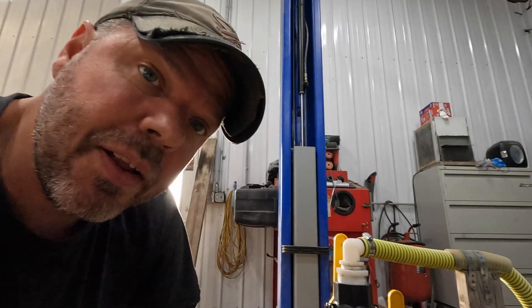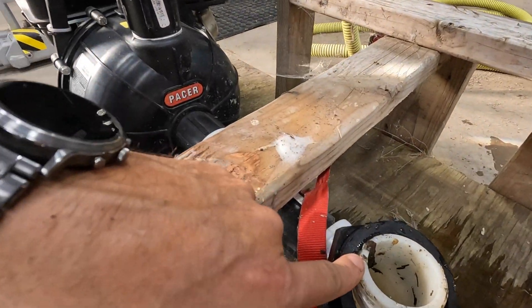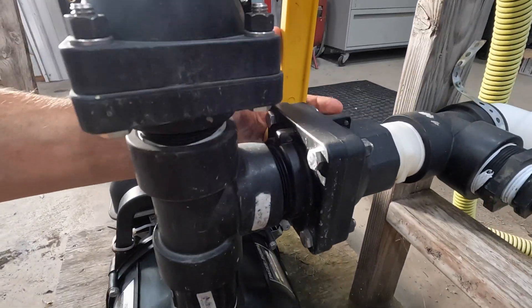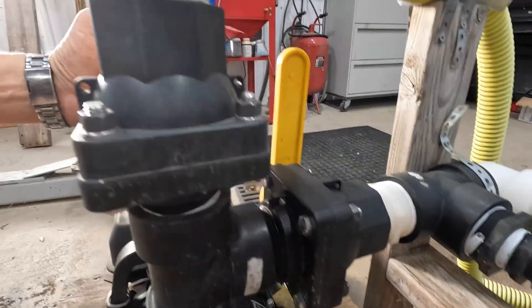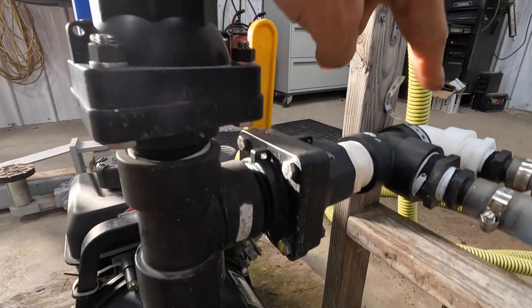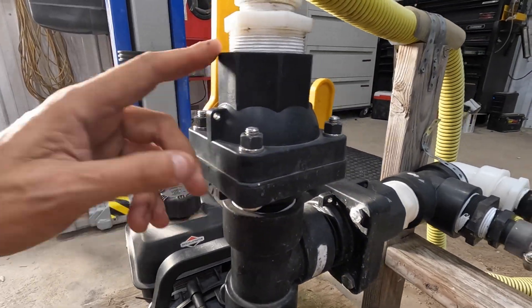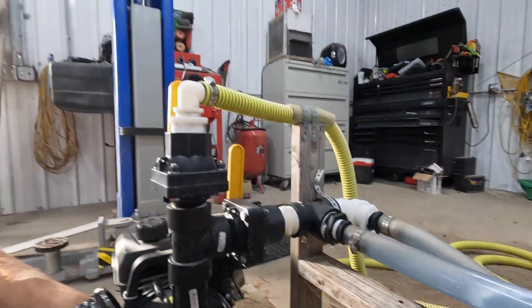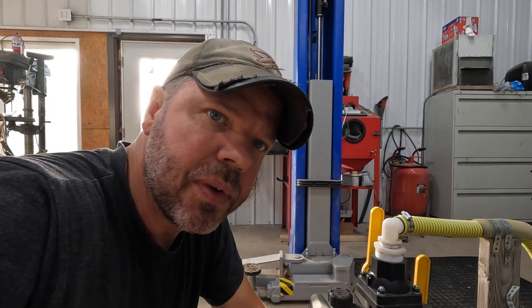Effectively, all this pump is: you get your main inlet feed which goes in here, and this valve — here's your output without that tube. But this is your bypass: if you shut this and open this, it'll recirculate the mix back into the tank so it just turns it up the whole time and you get a good slurry that you can apply.